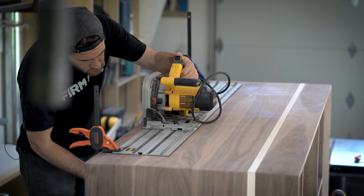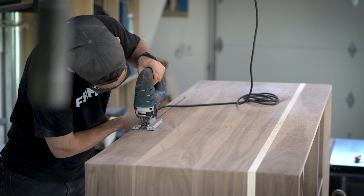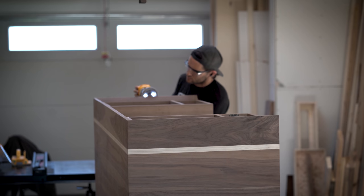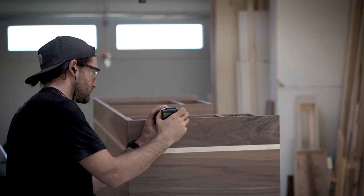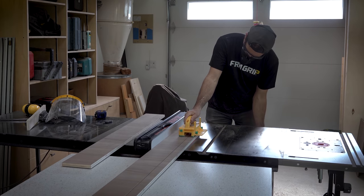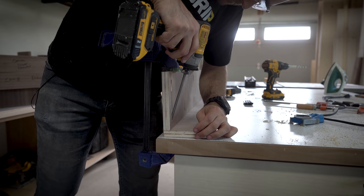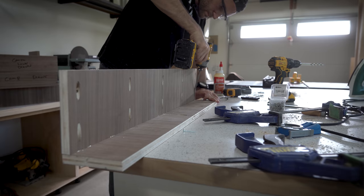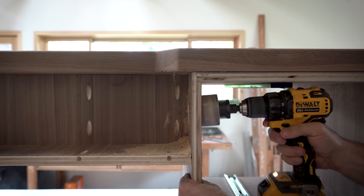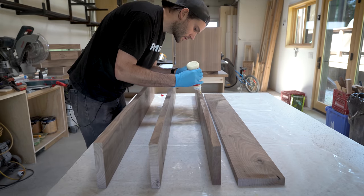On the top side of the desk I used my track saw and a jigsaw to cut out a small wire chase, allowing peripherals on top to route their wires down to the computer drawer below. While the desk was at a convenient working height, I applied a slight round-over to all the hard edges — given how accident-prone I am, I don't want a desk with sharp corners. To conceal and organize wires at the back, I made a small valence by ripping two pieces of six-inch plywood and screwing them into an L-shape with pocket hole screws. The valence hides wires and gives me a discreet place to mount a power bar and monitor power adapters. I also drilled wire management holes, stopping just short of drilling through so I could flip and finish from the other side — that way you avoid blowout.